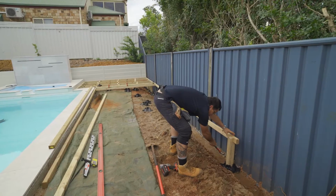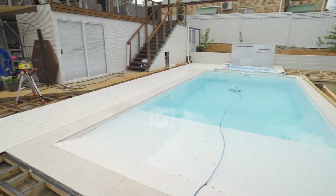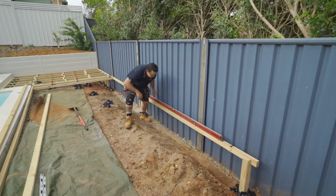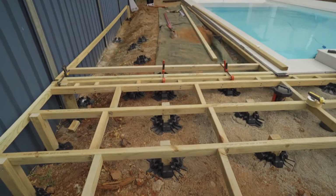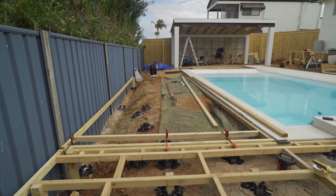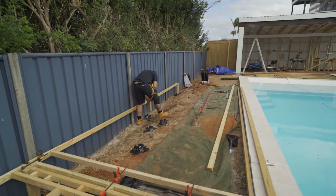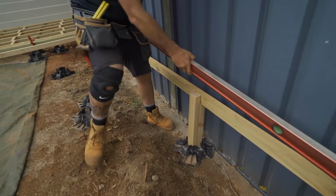When building on a slope, make sure to level the ground under each block by creating terraces. Once you level your outer joist, it's a case of measuring the height from the base of the tuff block to the base of the joist, and then cutting a checked-in post to that height. For an in-depth tutorial on this, click the video above or in the description.